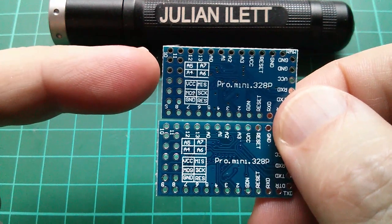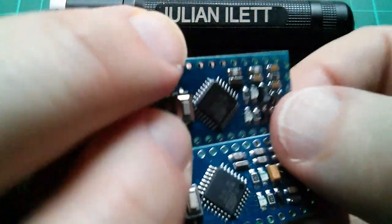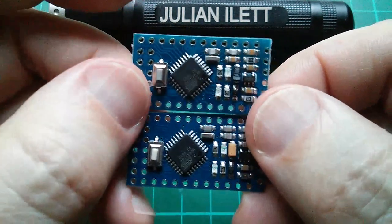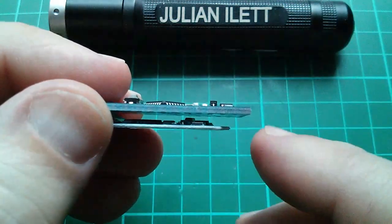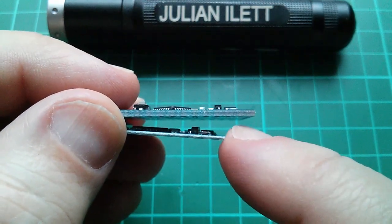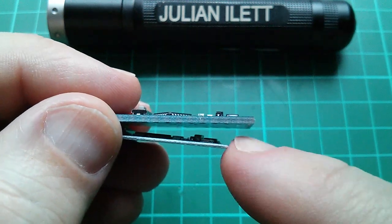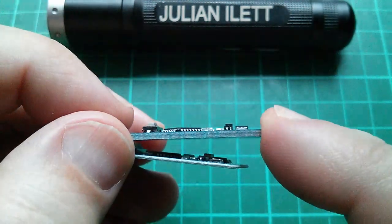On the back they are identical in the arrangement of pins, as you'd expect them to be. On the front they're very similar, and the switch is similarly close to that row of pins. They are fairly different though, these two - if you look from the side, you'll see how one of them is massively thinner than the other one. Unfortunately I've mixed them up. I think the second one I opened was the really thin one. Look at the difference in PCB thickness - this one's ultra-thin, which could be useful but might also be a disadvantage. And this one's full thickness, probably FR4 fibreglass board.